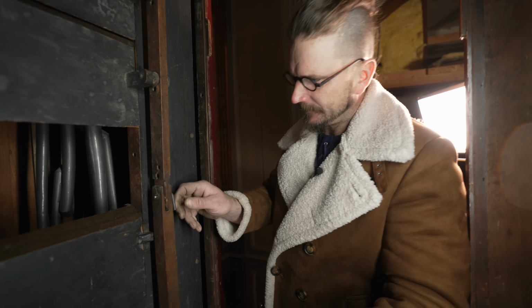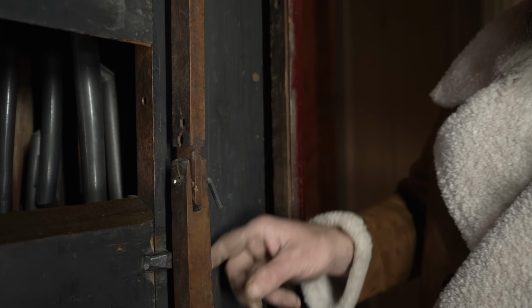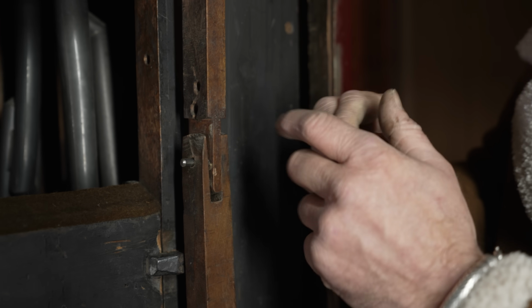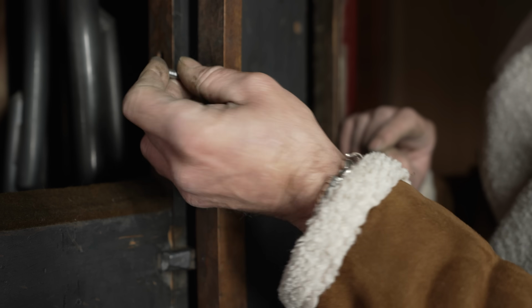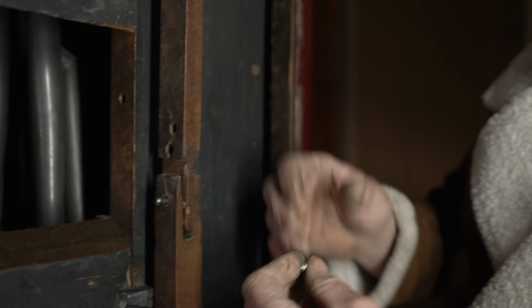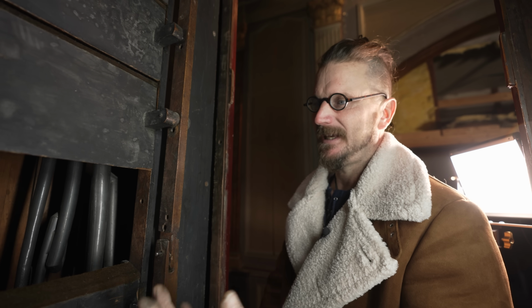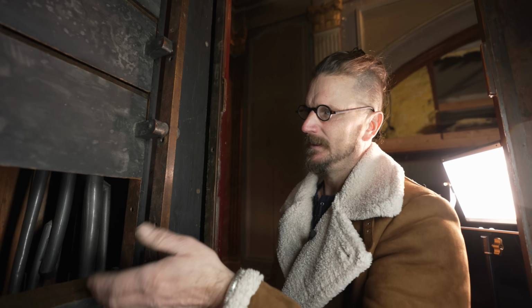Right, let's do it. So this is the little L dowel I made earlier to join this mechanism, which is perfect. Sorry, it's not perfect. It needs a little bit of trimming on the end. But it only needs trimming because now we're actually going to utilise this bottom one, which was broken. It wasn't at the cathedral, and you can see by the damage on the pin that it hadn't been connected for a while. So it makes sense, if it's an actual piece that moves, we need to have it moving because that's another bit of the sound that will be let out by the flaps opening.